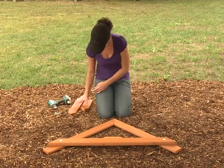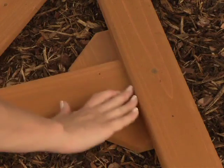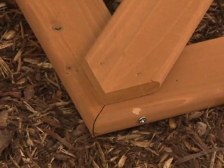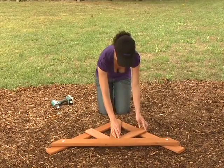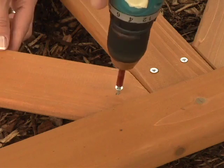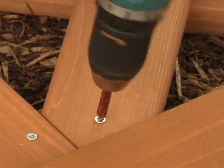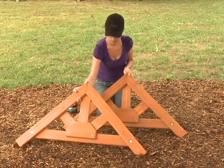Turn the assembly over and place two 224 center gable boards on the sunburst tight to the top of the gable bottom so the tip is centered at the peak of the roof support assembly. Place one 225 gable board A tight to each side of the center gable board so they are tight to the top of the gable bottom. Attach the center gable board with four S20 wood screws and both gable board A's with three S20 wood screws per board to the sunburst, roof support, and roof support left. Repeat this process with the other roof support assembly.